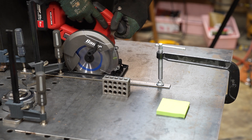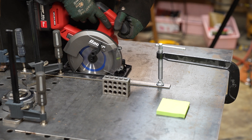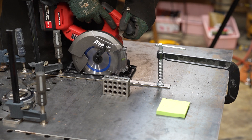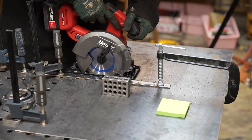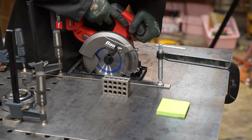I've since bought the Hercules Cermet carbide blade and it's a major improvement. I double-checked the blade, made sure the saw was spinning correctly, made sure it wasn't wobbling, swapped to a fresh battery, and tried raising and lowering the cutting depth, but nothing really helped. This is the saw cutting in real time through 1/8-inch or 11-gauge mild steel.